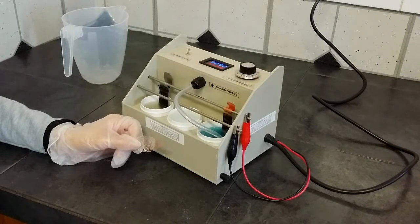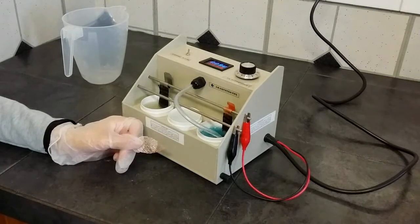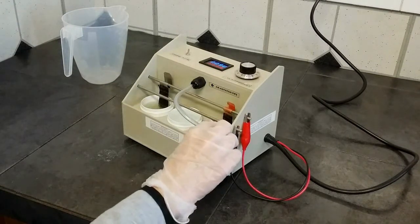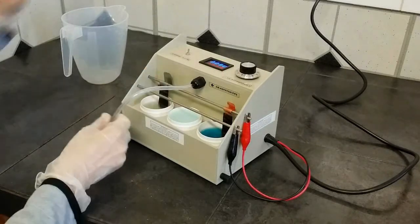However, please take into account that these factors depend on the material your object is made of and also on the surface area of your object. So you will need to experiment with each object you are plating to find out what are the perfect conditions for it, meaning that you will need to experiment with the power and the time you leave your object in the solution for. Now our electroplating process is finished, so we can rinse our agitation pipe and switch the machine off.